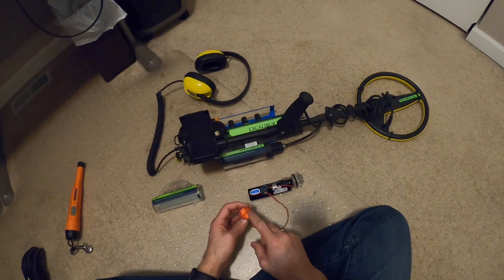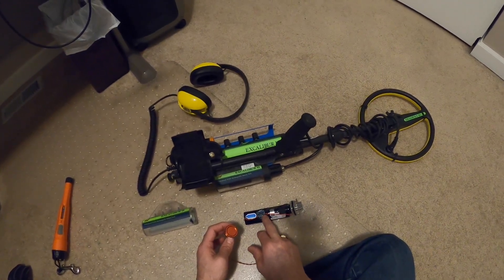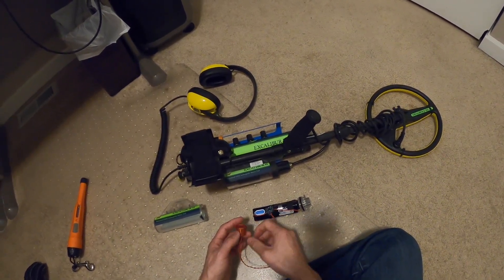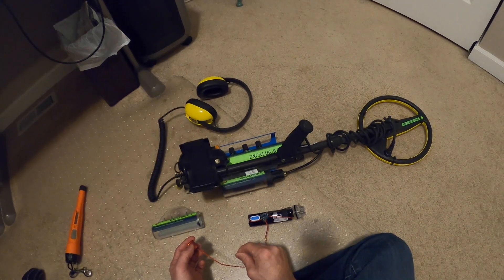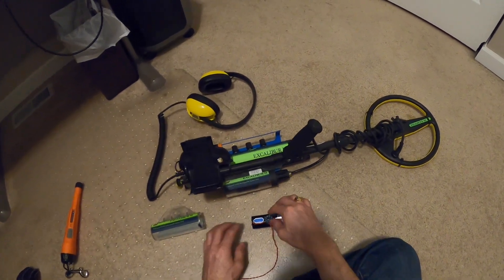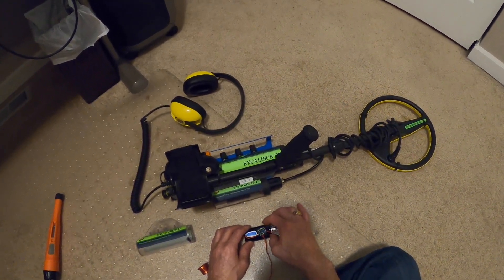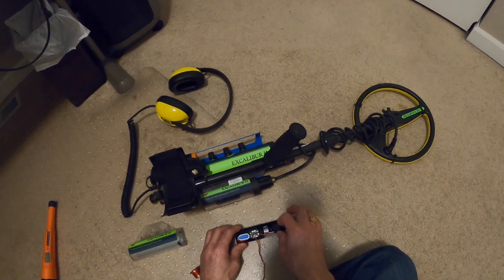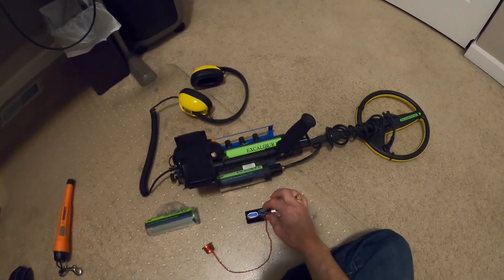What we have here is a piezoelectric switch and a control board. This is a piezoelectric crystal — basically whenever it gets flexed or bent, it generates a little bit of voltage, and that voltage gets translated. We need a flip-flop circuit because with each pulse when you push it — it's a real small pulse each time, not constantly on or constantly off — that's what this little circuit board handles. This is a push-button circuit by Adafruit Technologies. I was actually going to design my own, but this is Lady Ada, the owner of that company. I believe they're in New York — she's an amazing electrical engineer, and they've got all their in-house pick-and-place surface mount electronics circuit board production facility.